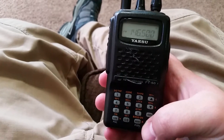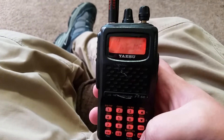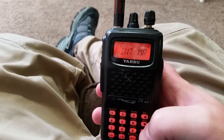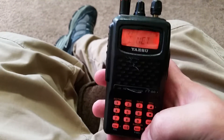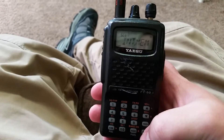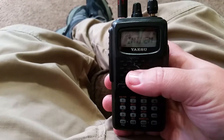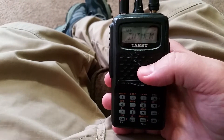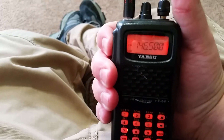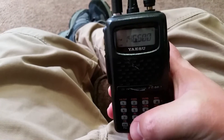The best way to bypass that, even if WIRES is active: go to your set menu, go to menu item 23, and select a blank memory. I have memory number three as blank — just make sure it's blank. Then go down to INET, hit the function button, and go to INT MEM for internet memory. That way it's going to select whatever code you have saved in that slot — which happens to be nothing — as the code to dial into WIRES. Set that, hit your PTT, exit out of it, and now no more beeping. We can go ahead and turn that off anyway.